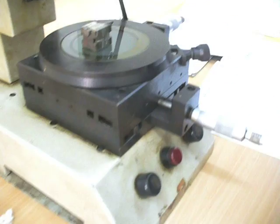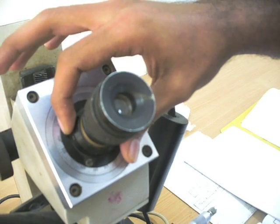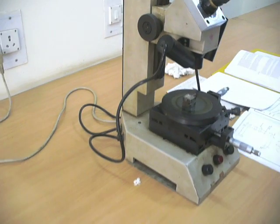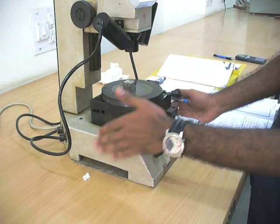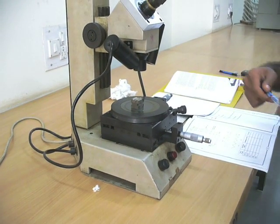And you have one more measuring device. You can see the 360-degree measurement here. It's called the eyepiece protractor. It's used to measure the angle between two crests of the threading angle. And inside this you have a hollow. You have a bulb here, and it's completely hollow, such that the light comes out, and you have a transparent glass here. So let's switch this on.